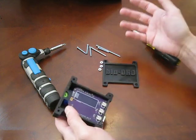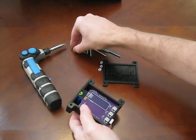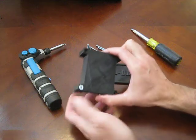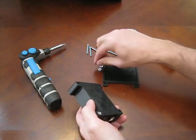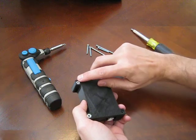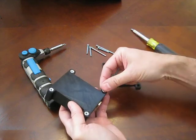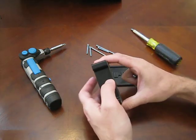That's important so that if I lose a screw or something and I have to open it up for some reason — I mean, I've already opened this box several times. So it's nice to have a box where I'm not screwing into plastic. I'm actually screwing all the way through to one of these nuts that's pressed into the bottom. As you can see, all the nuts just press right in. They go down a little bit farther than flush so that they never stick out too much, and they're tight enough that they don't fall out.